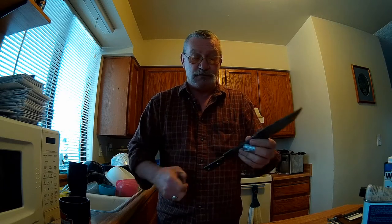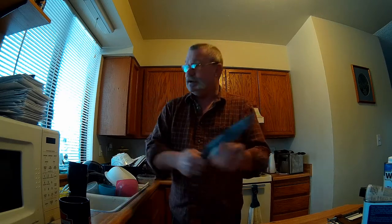So I thought we'd try an air quench. I reheated the knife to critical, took it outside in the winter air with my tongs, and waved it back and forth until it cooled off. File-tested it again — hadn't changed at all. The file still dug right in, no problem.